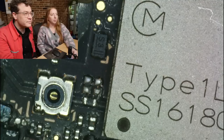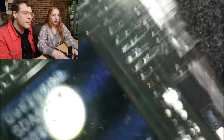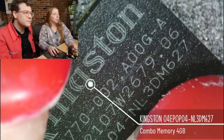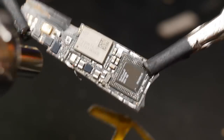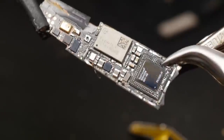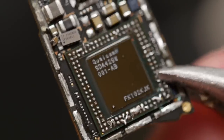The other biggest components on this board were the Kingston memory chip and what was underneath it. We identified this as a combo four gigabyte LPDDR3 memory chip. It's a BGA with all of the balls around the edges. I was hot airing the board to get the can off, and the Kingston chip just fell off — and I was surprised that there was something else underneath it.